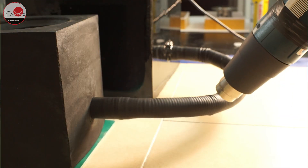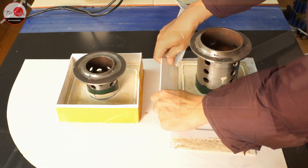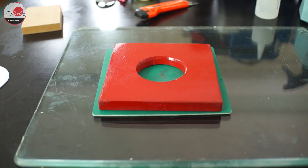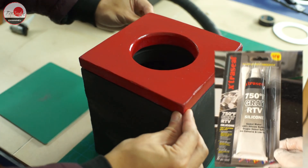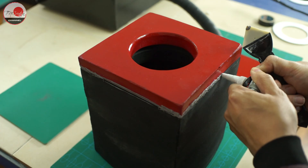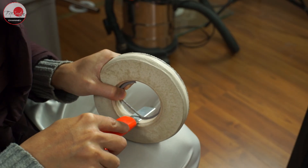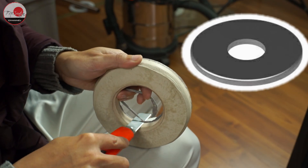Now I am making two gaskets in refractory mortar to accommodate different sizes of metal casting flasks. I use my flasks when making these molds, leaving small spaces between the flasks and the gasket's mouth — you don't want it too tight. The larger gasket is glued permanently into the chamber using high-temperature RTV silicone, since my biggest flask fits that hole. For smaller flask sizes, I place the second gasket on top. I also made a smaller round gasket instead of using the square one. Really, all you need is a proper metal washer that fits your small flask.